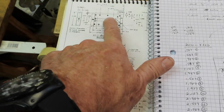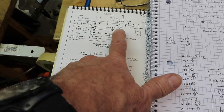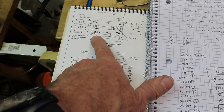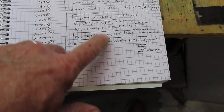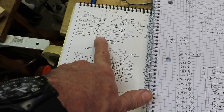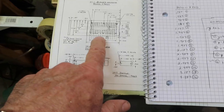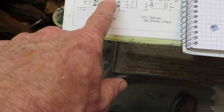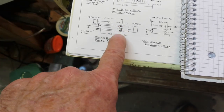Here's the plan and the print. The nice thing about these prints is they're laid out in a geometric fashion, sort of like you would do for CNC. That's what I used to lay out my drill holes, and I've also laid it out on paper so I can remind myself what to do. My project for today is getting the body machined out and all these holes drilled and tapped. Next time I'll probably do the top plate which has hundreds of holes in it, machined out of the 3/16-inch brass. Since I'm machining the body out of half-inch brass, one part will just be machined in place.